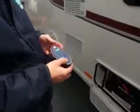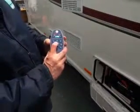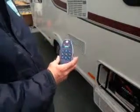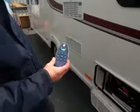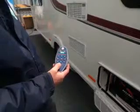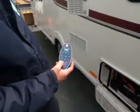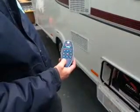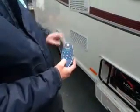To get the motor mover onto the wheel, press and hold the orange button first, then press the movement button. You'll see the light starting to move and hear the motor engaging onto the wheel. It will keep doing that until it's finished. Once you've got a solid green light, it's ready to move.